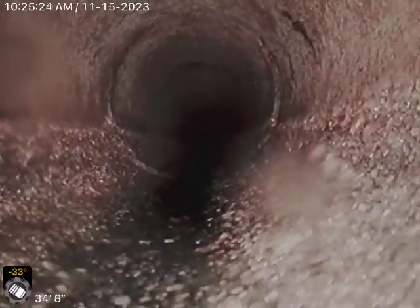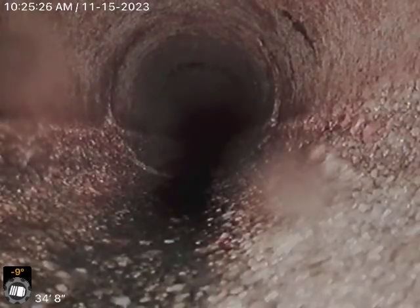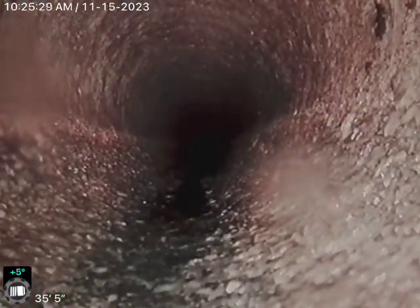We are still running with positive grade, bouncing back and forth. Right here, the concrete structurally — I don't see any root penetration through the joints. I don't see any pipe separations or misalignments. Everything right now looks intact. There's a little bit of buildup right here — looks like some concrete that's starting to deteriorate off the side of the pipe, as well as what looks like a little piece of toilet tissue that's kind of stuck there.